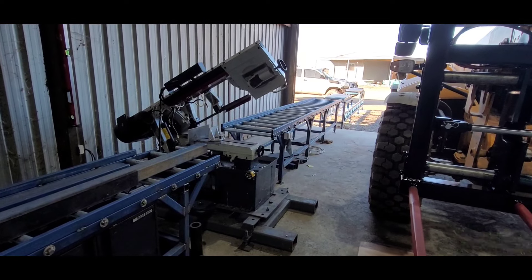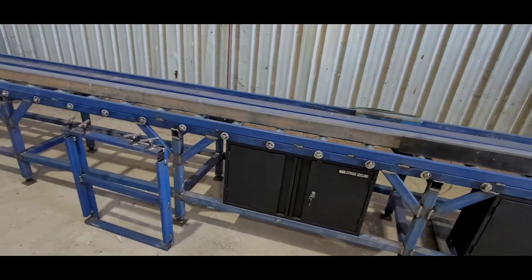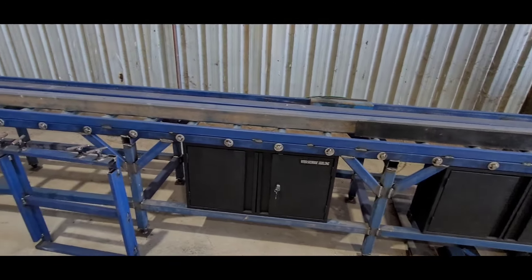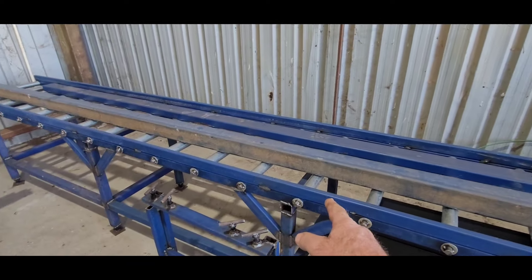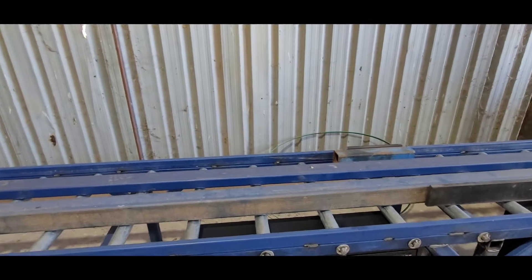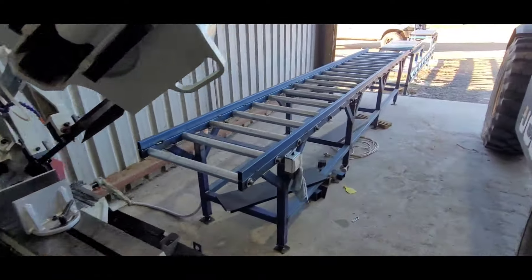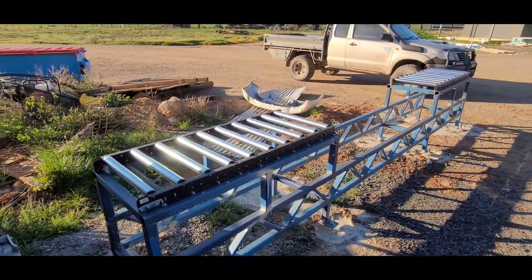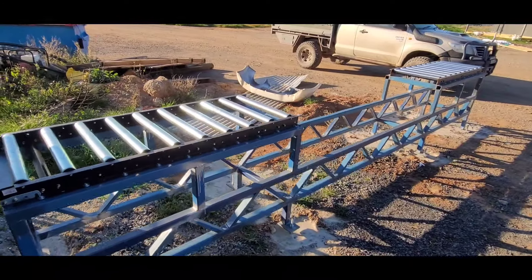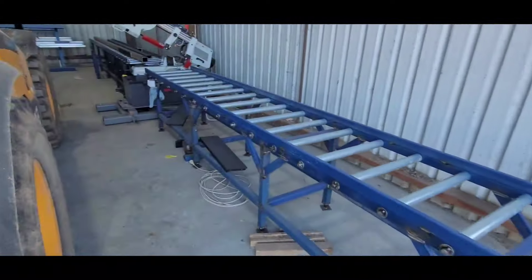I knocked up the rolling rack a few weeks ago for the bandsaw, plus a couple of cupboards for the coolant oil and blades. That's my jig — you sit that over there for when you're doing repetitive cutting. You can clamp that and get everything correct so that you don't have to measure it 10,000 times. Set that one up outside with a cutaway unit so you can lower heavy lengths down with the forks and then slide it up to cut.